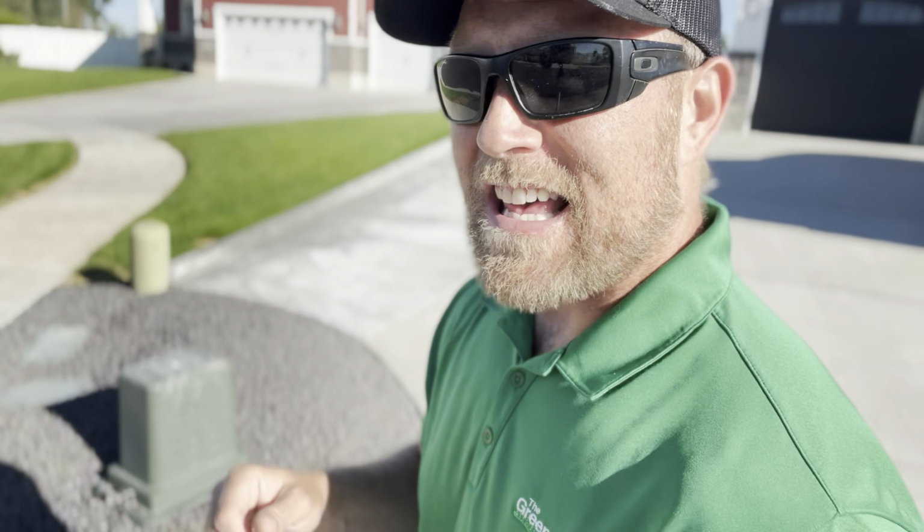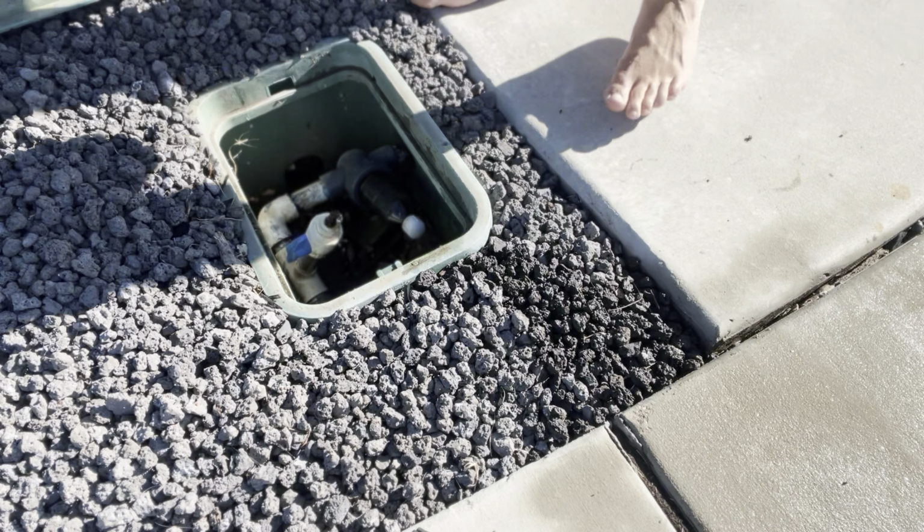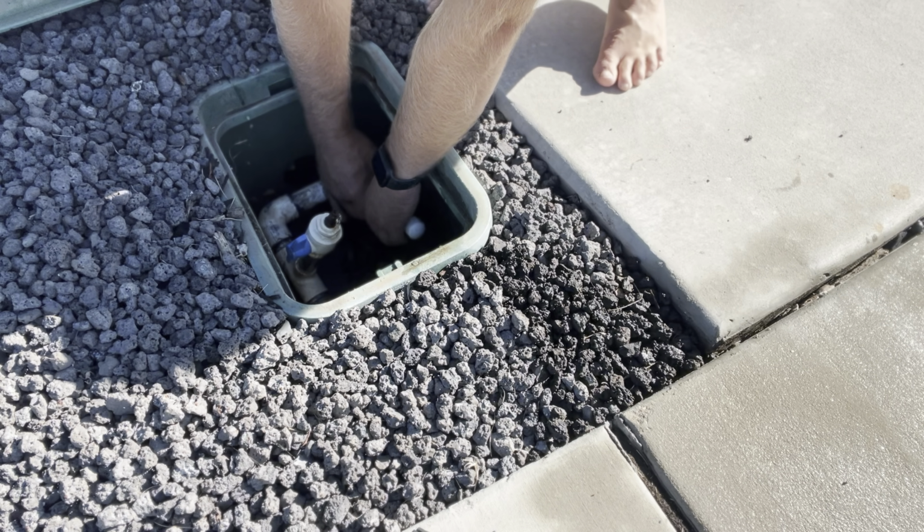For the Irrigreen system, there has been one trick for me. I am on secondary water, and so I get a lot of different materials that come down and pollute my line. I get different algae, different growths, snails, everything that comes down. The problem with my line is that on a very regular basis, I have to come into my filter and drain this off and clean it. Put my hands in here where there could potentially be spiders.